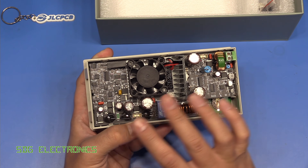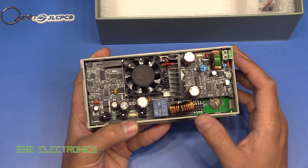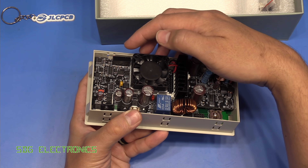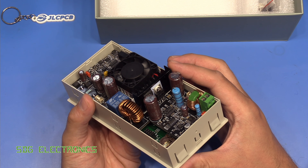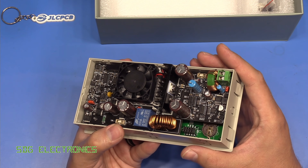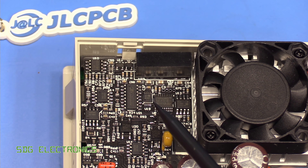I don't know whether this is a redesign board for all of the 6006 versions or whether it's just a spin for this precision version, but there's a lot going on here that wasn't there previously. I can see an isolating DC-to-DC converter, which is quite interesting, and quite a chunky heatsink which didn't exist on any of the previous boards. This top section appears to be where all the magic is happening, and this is definitely a version of the PCB just for this version.